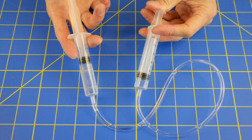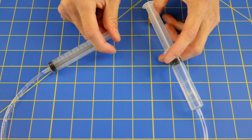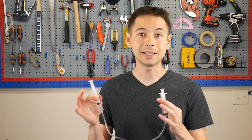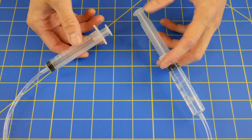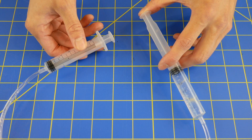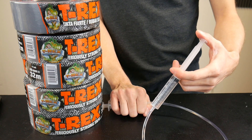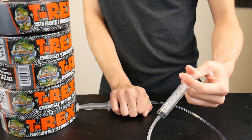By contrast, here's a hydraulic system. If I force this one to stay in place, I cannot compress the control syringe. Water is very, very hard to compress. Even if you put a water balloon at the bottom of the ocean, that pressure will not reduce its volume significantly more than if it was just sitting on this table. By contrast, air is relatively easy to compress. So in essence, any force that I put into this syringe is very effectively outputted in the other syringe, which means all the force from your hand is transmitted through the hydraulics, making it pretty strong.